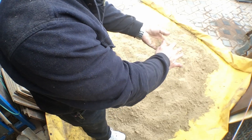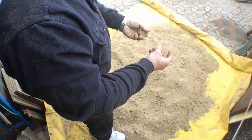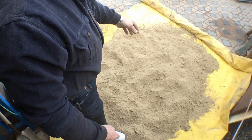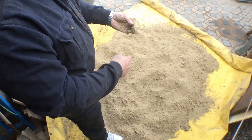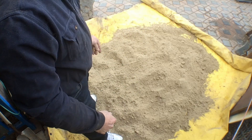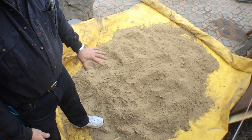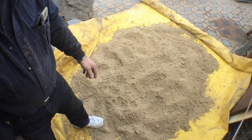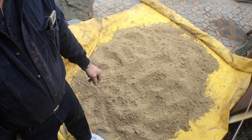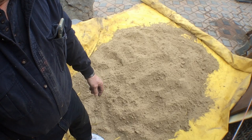Well, that still feels just a little bit dry. We mixed a little bit of water in there, and what I'll do is riddle it back into the sand bin. I'll probably have to do this one more time to get it tempered the way I think it should be to start casting. I expected it to be dried out quite a bit more than it was, but it's been cold enough over the winter, and I did temper it right before the last time I used it and added a little water. This is about two-thirds of the sand stored in the bin - we'll get it riddled through, let it set overnight, and check it again tomorrow. Hopefully we'll be ready to cast this weekend if the weather holds out.